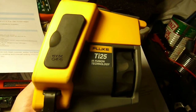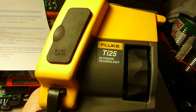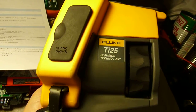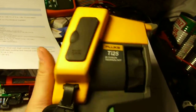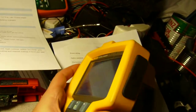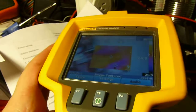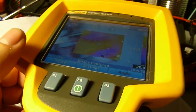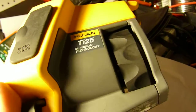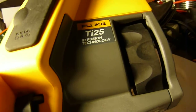If you're working for a power generating station and you have a turbine fail because of damage to ball bearings, the cost of losing production is much, much higher than buying one of these. I highly recommend this product. This is not a toy and not something a hobbyist would use. But if you can buy a used one or a lower resolution model - FLIR makes those cameras as well - I prefer Fluke. You get better bang for the buck, more features and higher resolution for the same amount of money.